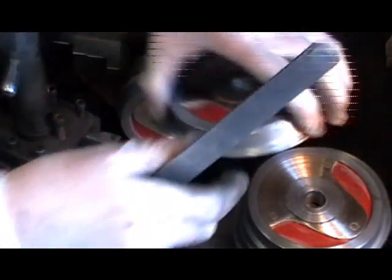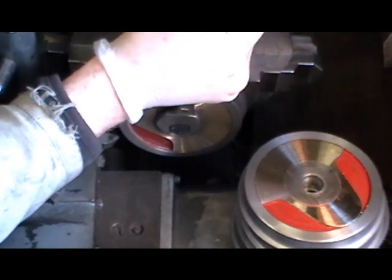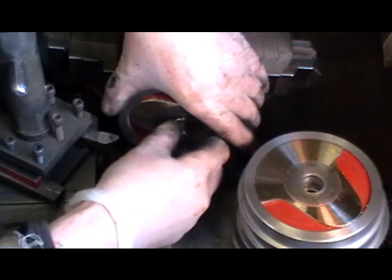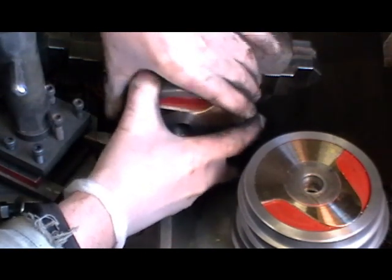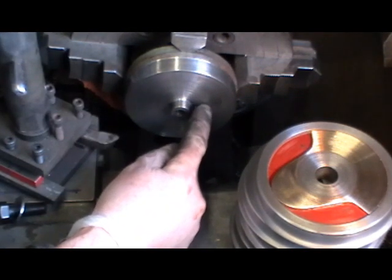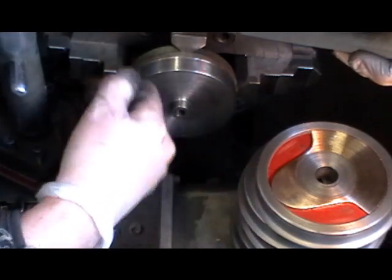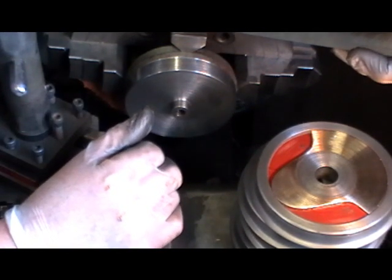They're all here now finished. The next operation, while this jig is in, I'll take this wheel out just a second. In this jig I have got to — and this is how the book tells you to do it, there are other methods but we'll stick with the book — from the centre of this jig I've got to mark a cross on the centre line one inch, put a centre-pop mark, and I've got it centred in the lathe so the jig will then be running offset. I've got to drill on that centre-pop mark a hole — I think it's 9/16th diameter.